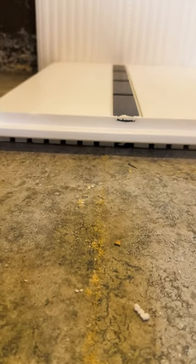One of the things that's real simple that we're going to be doing on this project is putting the Insofast panel down on the floor. If you get a little bit of dampness or anything coming through, this separates your subfloor and your carpet from the water, so you're not going to be vacuuming up water if you get a little rainfall and it seeps in.